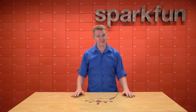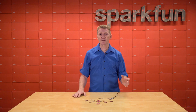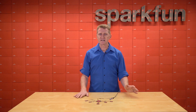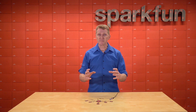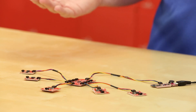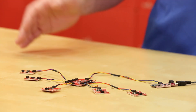Why might you need multiple humidity sensors in a single project? Say that your new hobby is making bread — once you start mixing the art and science of it, you'll realize that humidity plays a really important part in the fermentation process. Say you're making a chapati, a challah, and a khachapuri all at the same time — you'll want very specific humidities in each section of your proofing cabinet. Or perhaps you need to use both visible light and near-infrared spectral sensors to detect certain toxins in blood samples. Both of those sensors share a single I2C address, so if you want to use them concurrently, you need a Mux.